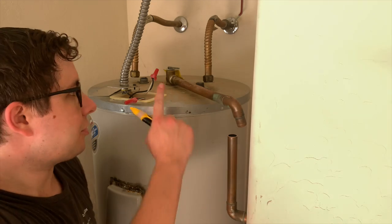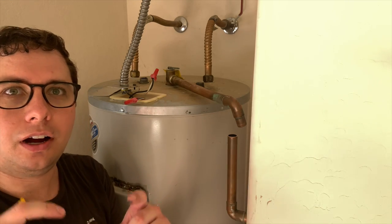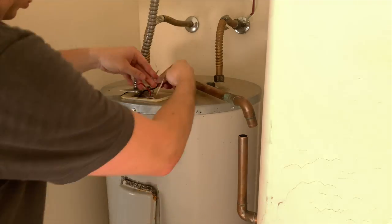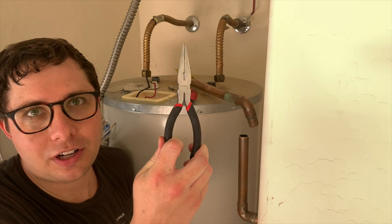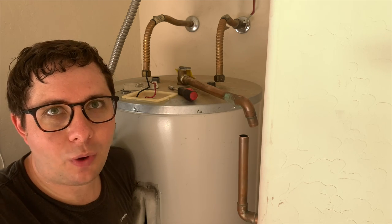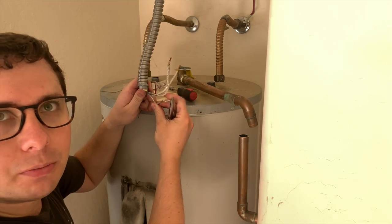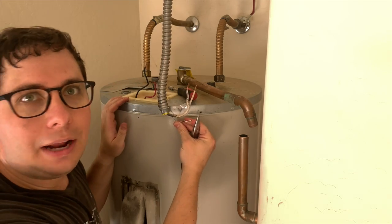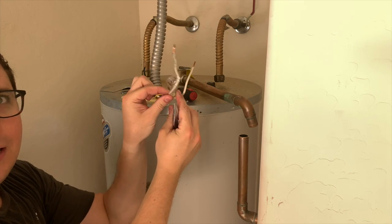The final thing is to disconnect the electrical connectors. We should always test with the voltage tester to confirm the power is off. I also suggest taking a picture of how they're connected so if you run into trouble down the road you can reference it. You'll definitely want some needle nose pliers to disconnect the electrical connections. The water heater will have a black and a red wire plus a ground wire coming from your junction box. The ground connects to the metal plate, and the red and black connect to the red and black on the water heater. I put a piece of tape on mine labeling which wire was connected to the red.